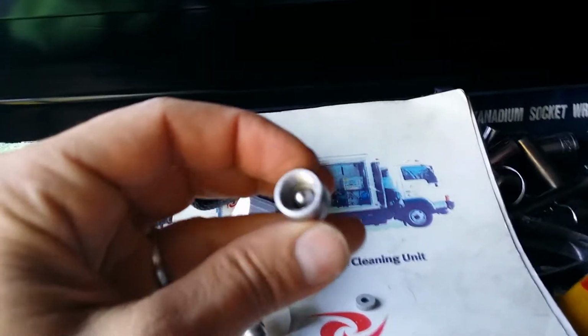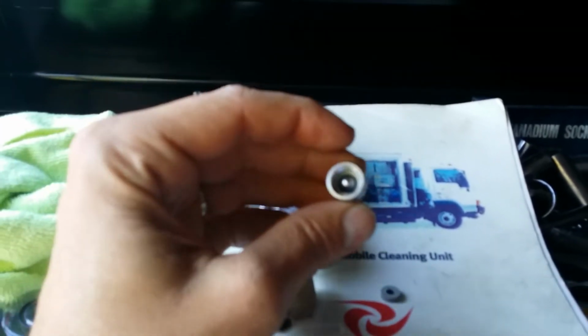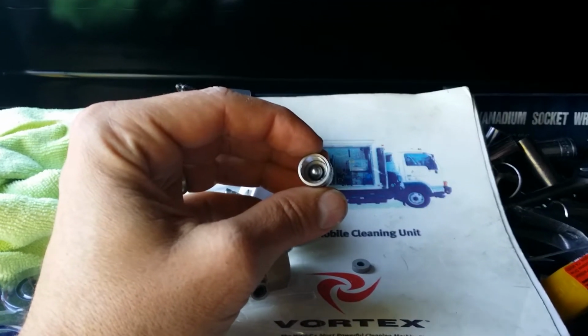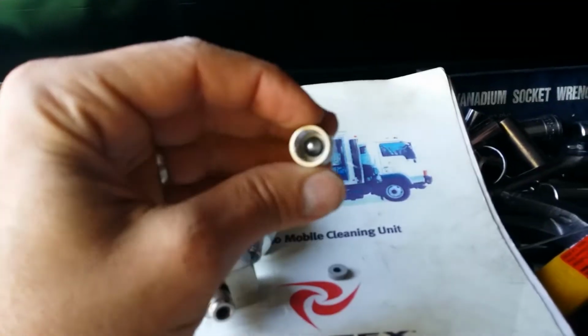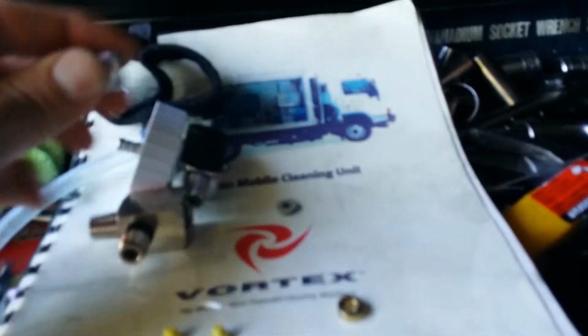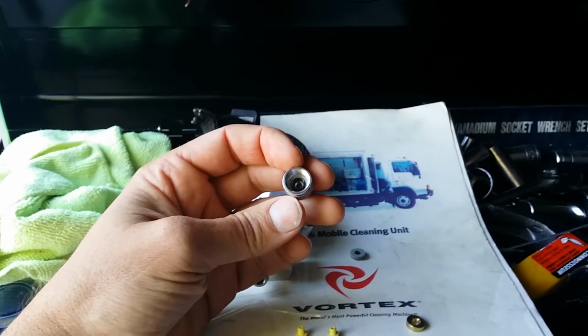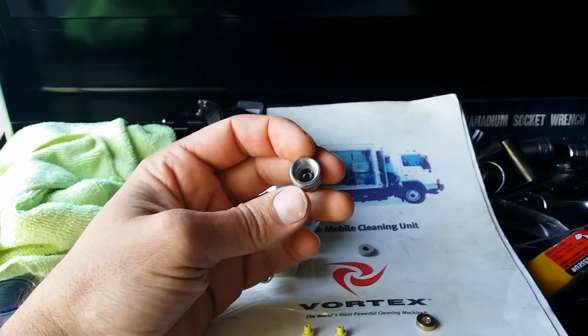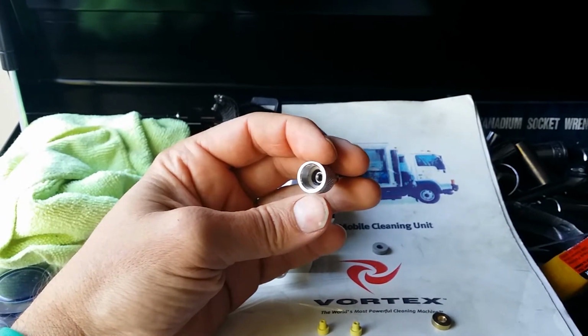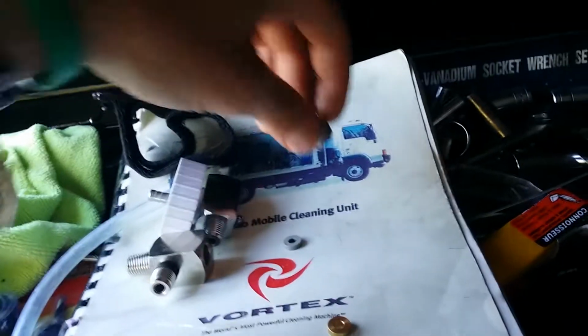Okay, so pull that cap off, and you can see a little ball bearing in there. That bearing sits on a little replaceable O-ring that when that O-ring corrodes, and it will, water will leak by, and actually if you set the jug down, it'll refill itself because you're not closing off that channel. The back pressure will get it. So I can get that thing out of there. There. You can see that little, boy, that sucks. There it is. You can see the O-ring, and it's actually held in place by a little plastic washer that's on top of it, which is not really viewable.